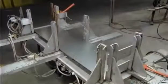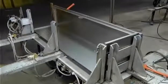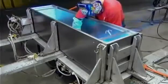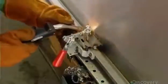Meanwhile, they've bent pieces of steel to form the locker's top, bottom, back, and sides. Now they weld those parts together. Then they weld the hasp, the steel loop through which you hook a padlock to lock the locker. The hasp goes on the edge of the body and protrudes through a slot in the closure cup in the door.